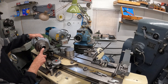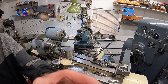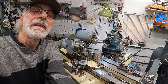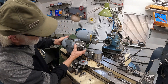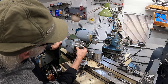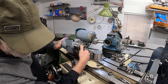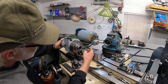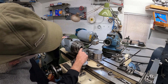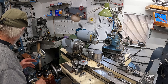This is an old grinder and it came with a large Brown and Sharpe taper. What I did was find an old 5C adapter for a lathe, ground the OD of it, and pushed it into the taper. It didn't run too true, so I got an internal grinding attachment for this machine and ground it internally to true it up. It's a little chewed up but I only needed to clean it up enough — and it runs true. It's a very nice setup.